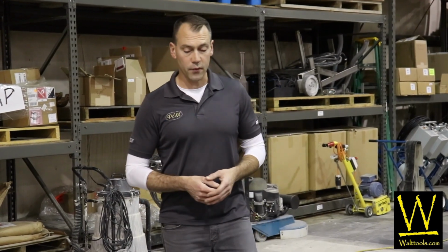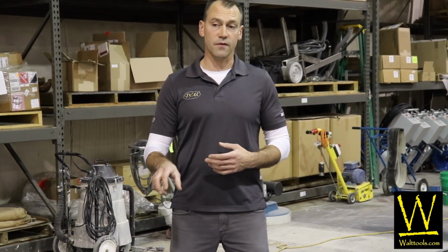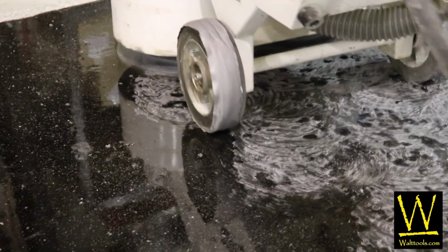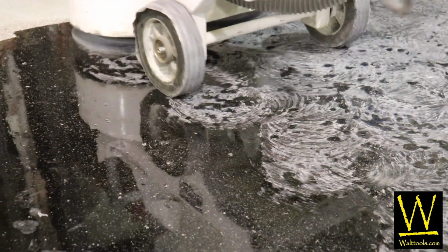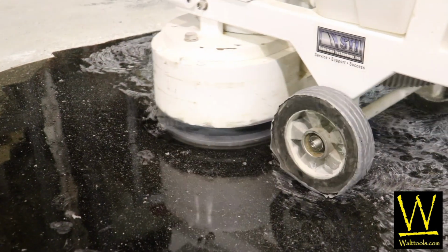Now, Don talked about improvisation. What we did here, what I did with the urethane, is filled in all these tiny little holes, the voids that are there from the bubbles. We removed the bubbles' crown, but the void is there nonetheless. So we still have an open space in the floor that would show through, because it's obviously an elevation inequality that's going to translate or telegraph through that next coating.